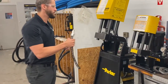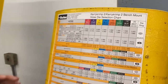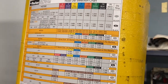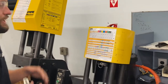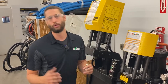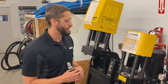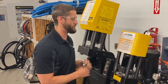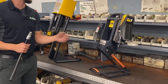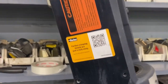Once you have all that information, you come over to your crimper. Another nice thing about Parker is every one of their crimpers from the factory comes with a die selection chart. These encompass all of the hose and fittings that the crimper can do, but we can actually customize it to only include the hoses you're using. When we look at the Parker mini crimp, it has a cool QR code on the side that you can scan and it'll take you right to a website showing the die selection chart for that crimper.